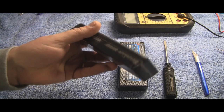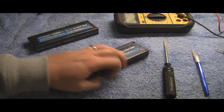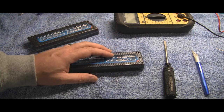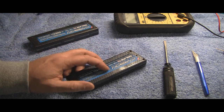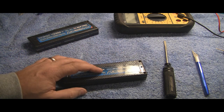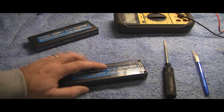These are the Orion 4600-45C packs and troubleshooting, basically. This pack here — both of these packs are good right now — but what had happened is this pack here had a motor go bad, went through the Speedo, and thought it fried the battery. Didn't fry the Speedo, but the battery just would not work. It wouldn't take a charge, errors on the charger, and a lot of people have had this same problem, not just with the Orion, but with the Gen-Ace, just any of the packs basically, and they're all the same internally. I have some Gen-Ace that I've since purchased, and I love them, and I've seen the inside of those exactly the same as the Orion's.